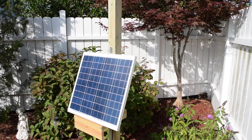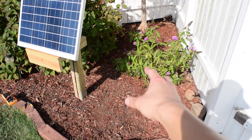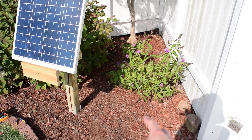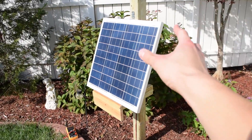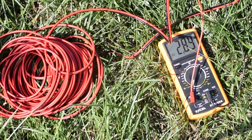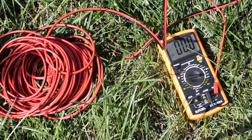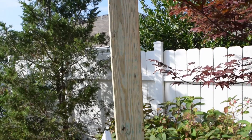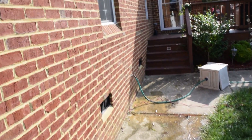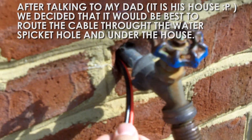There is room for another 50-watt panel here, and when I build the larger system I'll put another 50-watt panel on top of this one. We also left room for another structure that will house a 100-watt panel, so the final system should have a solar output of around 200 watts. Even in indirect sunlight, with about 90 feet of cable, I'm still getting 20 volts and 2.7 amps — short-circuit current and open-circuit voltage. Everything is looking good. I still have cable to route, so I'll get back to you when I've finished routing it into the room.